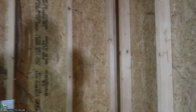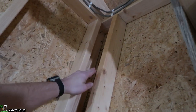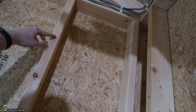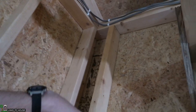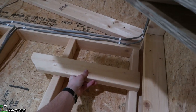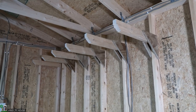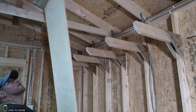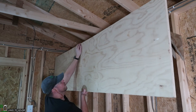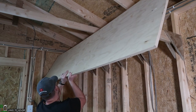I went out to swing with my daughter for a while and my light's about gone. Looking at this corner, I don't think I can get the support piece in here with the triangle in the back. On this side it's so close I'm just going to take one of those 2x4s and mount it straight onto the wall stud — it'll rest on that and be nice and strong. We might as well use the decorative piece since we have it, so I'll plop it up there as if it were a bracket piece. Now it's time to put that first sheet of plywood up.